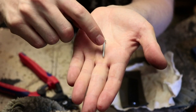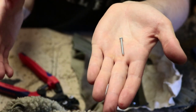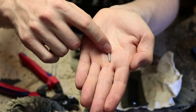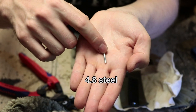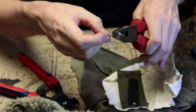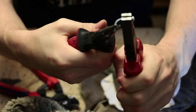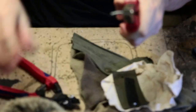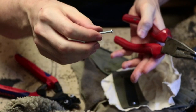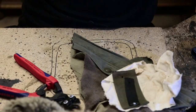When buying bolts, I always look for the steel number or denomination. These are made from 4.8 steel — it's a soft steel. If I take my pliers right here, I can bend them. I can just bend these bolts. In my experience, this is more than enough for the stuff I'm doing for the costumes, even if they can be bent and even if there are better bolts.